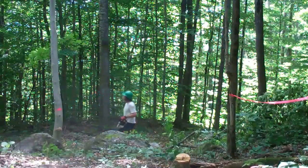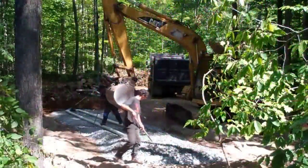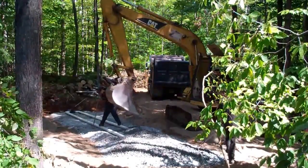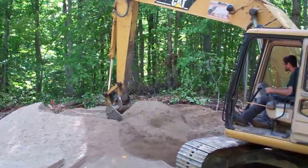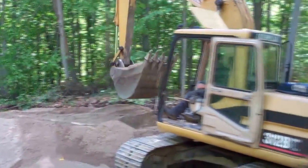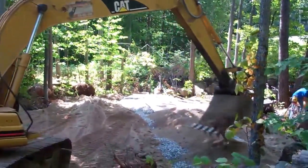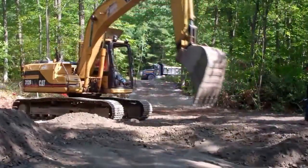We also selected the location of the house on the lot to minimize the amount of mature trees that we were going to have to cut and to pick the most sensible spot for a septic system. In this case, we were fortunate that there was a natural sunken area to one side with the perfect soil conditions, so very little excavation was needed for the septic bed. And after it was built up, the level would actually match the level of the house perfectly for outdoor living space.